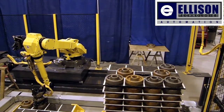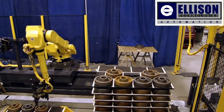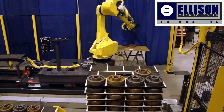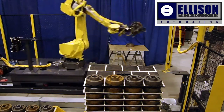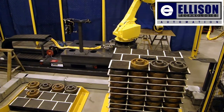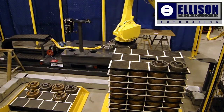This system was designed with future expansion in mind. Mounting the robot on an RTU allows for a second machine tool to be added to the system, which can be serviced by this same robot if there is more than one operation for a part. The robot can load and unload the first original machine tool, load and unload a second machine tool if added, and also pick parts from the inbound and place them on the outbound pallet stacking systems. Using the tool-changing system also allows for adding more tools to the system in case a wider range of parts is added to be machined.